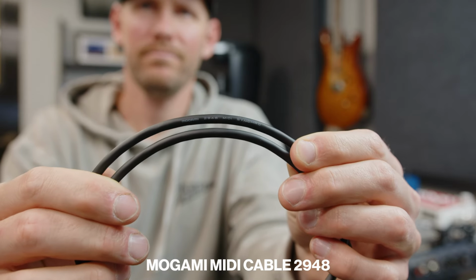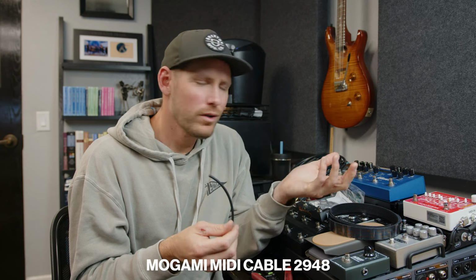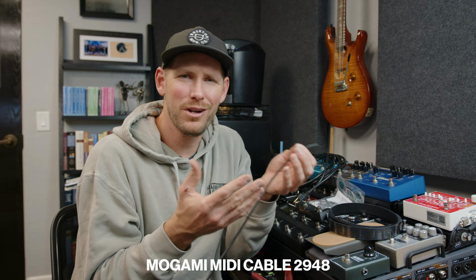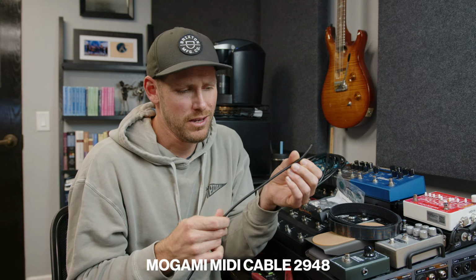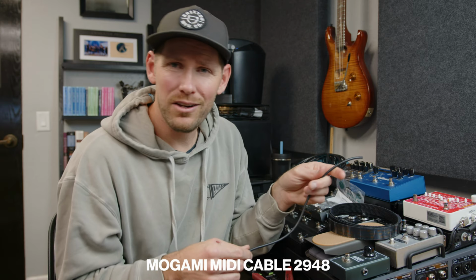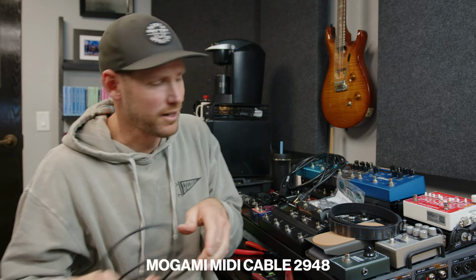Love those guys. Now, my favorite cable that I use for MIDI stuff is the Mogami 2948 cable. It's a 4-conductor with a shield, so that makes all 5 pins. You don't have to wire all 5 pins for a MIDI cable, but usually it's just the center 3. But whenever I'm wiring up a MIDI cable, I just wire all 5 because I don't know if I'll ever use that cable for anything else that perhaps needs all 5 connected. I just want it there just in case. So this particular Mogami MIDI cable has 5 conductors total, and it works really well. It doesn't really need any extra strain relief. It's easy to cut, and the shielding's easy to get around. Again, the next video will have more descriptions on that, but this is my favorite MIDI cable to use with that kind of stuff.